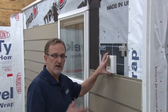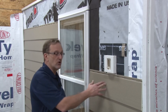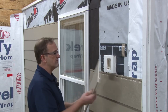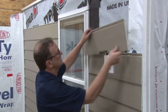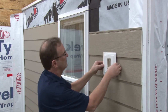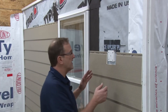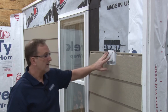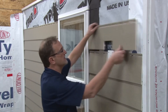When dealing with light fixtures and other obstructions on the wall, there are a couple different ways you can handle it. If the wall is a short wall — less than 12 foot in length — a standard siding mount block can be used. Leave a half inch gap around all four sides and install the snap ring. If your wall is longer than 12 foot in length, you'll need the one inch expansion room, so just fabricate a block out of some one-by material. This is a three-and-a-half inch square block; I'm going to mount a seven-and-a-half inch block on top of it.